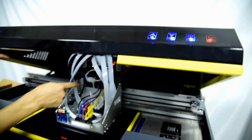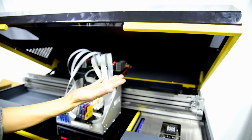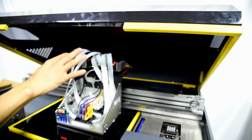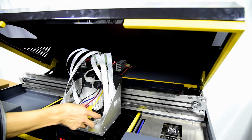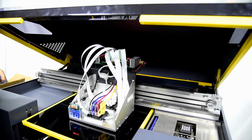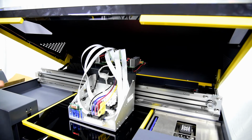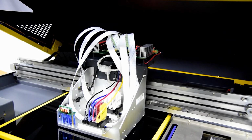The fresh ink goes to the sub-ink tank, then to each damper, and then back to the big ink tank for circulation. And be sure all the dampers are installed well, with no damage. Okay, so this is the procedure to load ink from the ink damper. Okay, thank you. See you next time.